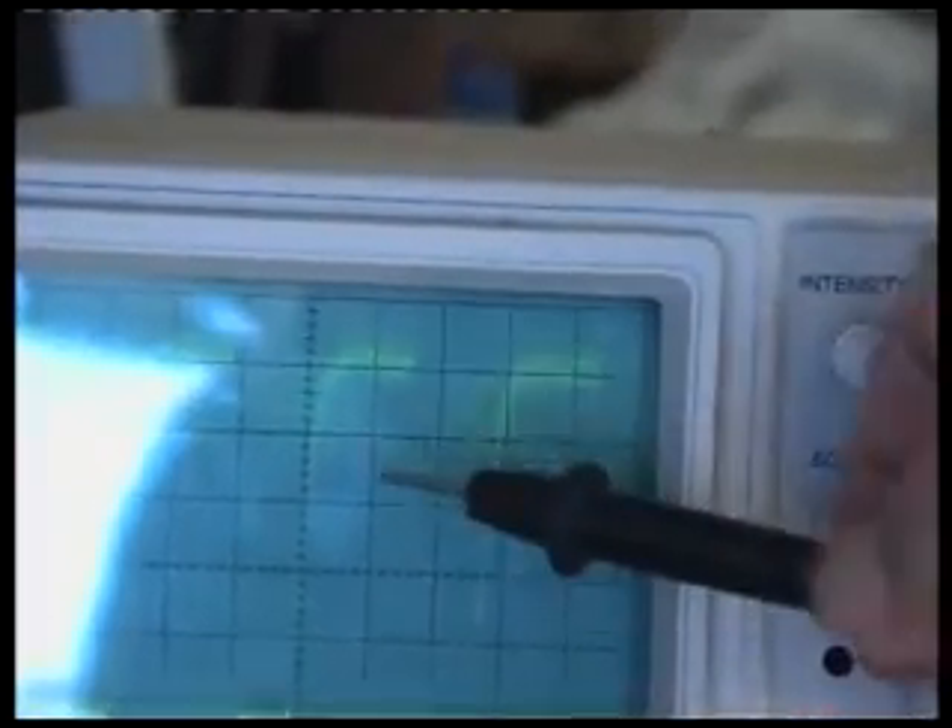When you see the curve going up, that is the RL time constant of the coil and the resistance of the coil. When it gets to the top it drops down. On the 48 kHz you can't get it to reach the time constant value before it crashes — in some cases it barely gets there. Looking at the voltage going in — times 10, that's 60 volts. The circuit uses harmonics fed into the cell, and that was a 61-plate cell, nothing like the 100-plate cell.